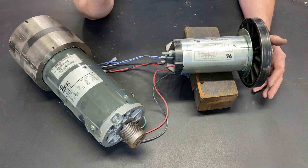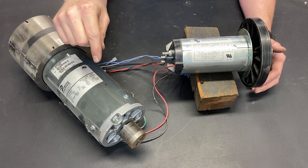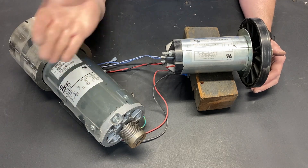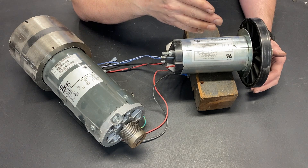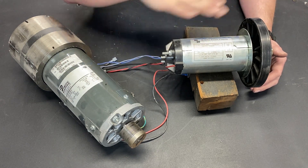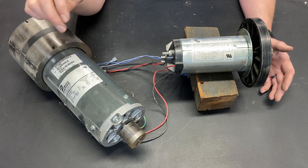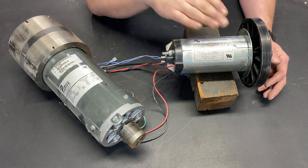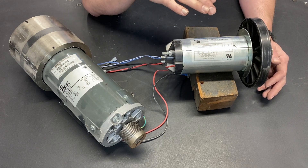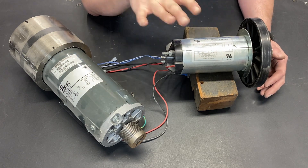So yes, those people are correct — it's the ability to do work and it's gearing. But here's the problem: horsepower is rated at max RPM. If you are putting a treadmill motor on something, it is because you want to vary the speed, and more often than not we're going to be running it at slow speeds. The moment you slow it down, horsepower drops. But with a DC motor, torque remains constant. That four foot-pounds of torque this motor has will be there at 100 RPMs and at 3200 RPMs. For the sake of this video, torque is constant.